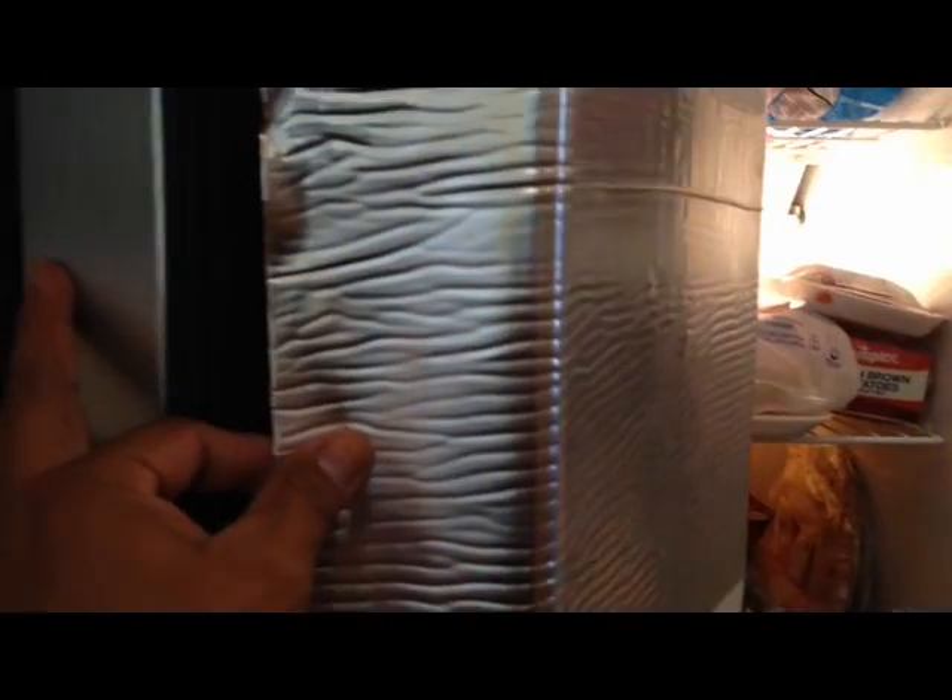Another way of preventing this from happening is putting insulation on the back here. If you do, make sure it's totally dry first — I'm going to use my heat gun to dry it off and then wipe it down. I ended up putting insulation back here; it's actually Dynamat, a sound insulation I had for my car. It works great — it's got foil on it and as long as it doesn't get hot in there, it'll be a good solution to keeping that hose unfrozen.